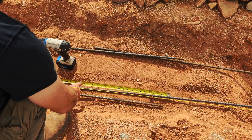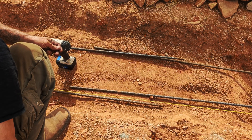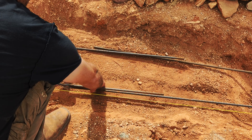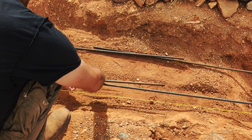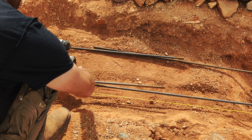Also just a little tip: if you tie rebar together, the rule of thumb is a 20-inch overlap minimum. That's what I'm doing here — just measuring to make sure I have the right minimum overlap on my rebar, and then I've got to do basically hundreds of ties.